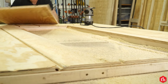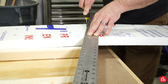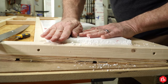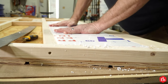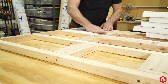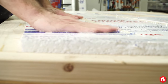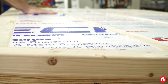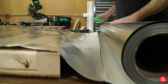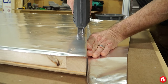The back wall is the same process. Now that I have all the siding attached to the wall frames, time to insulate. I'm using inch and a half foam insulation. You can rip it on a table saw or cut it with a utility knife and a straight edge — it just friction fits in between each stud space. Remember to cut the angle at the top. Cut and attach foil vapor barrier to the interior of all four walls using a staple gun, and seal the edges and any seams with foil tape.